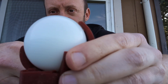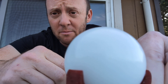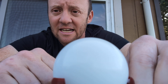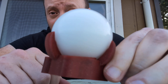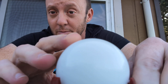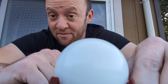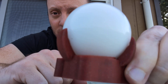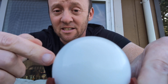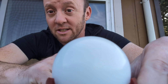So here it is. This is a POM — P-O-M, polyoxymethylene or something — an acetal ball. This is just a random industrial bearing, a 50mm bearing, so it's not particularly polished, but as you can hear, it's spinning very, very nicely. This is like a $1 or $2 part, and it spins and feels as smooth as any really nice trackball.